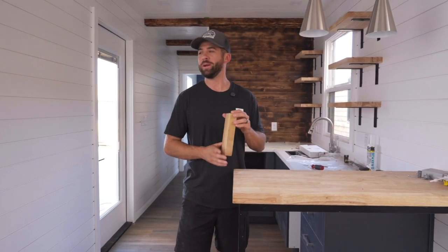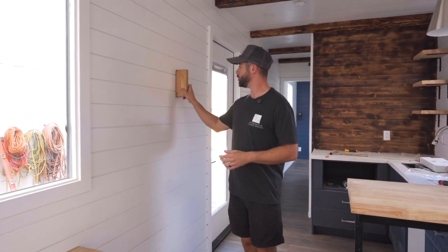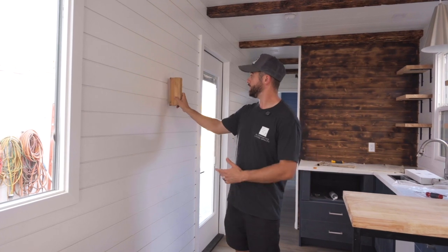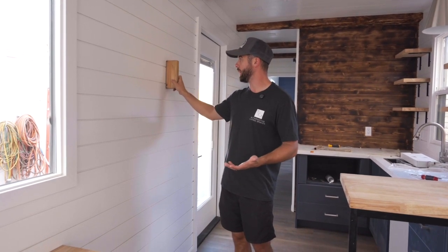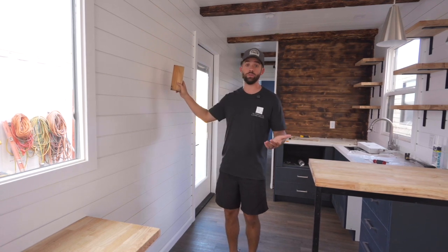We're using 2x4s. Now, this is a piece of a 2x4, but I want to use it as a demonstration. So typically when we're framing, our 2x4 is going a traditional way, just like most traditional construction would be. This goes almost up to the corrugation. There's usually like a 3/8 inch gap, and that's some additional space where spray foam can get behind it.